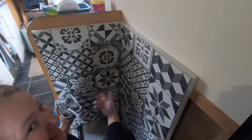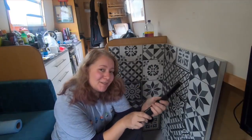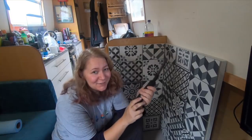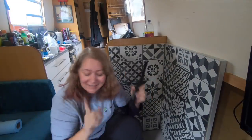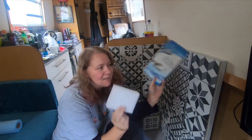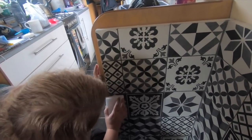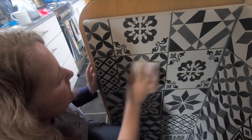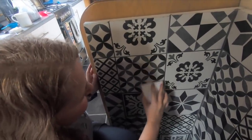The problem with the grey grout is you can't actually tell the difference. So here are our top tips if you are going to tile or install a hearth. One: you are going to need a torch if you are inside a narrowboat and you're doing any kind of precision work — this is an LED rechargeable torchlight. Two: when you're tiling you're going to end up with grout everywhere. These magic sponges from Poundland are fantastic, you don't have to wet them. I've gone over the grout with the wet clean sponge and then carefully take it right up to the grout edge to get rid of some of the film, because if the grout dries on the tile you're pretty much stuffed.